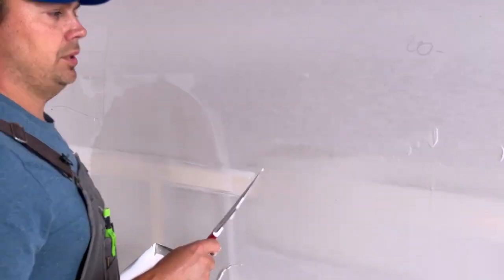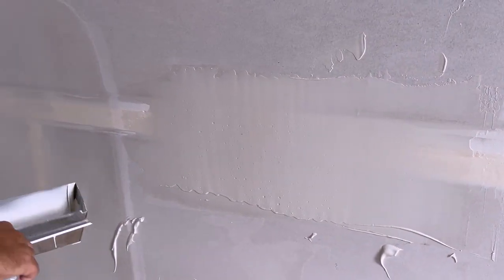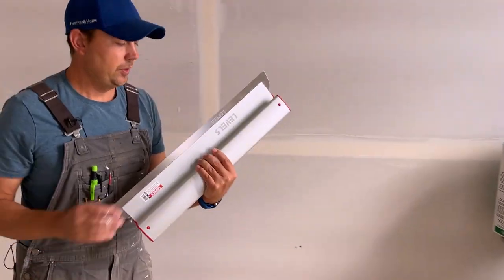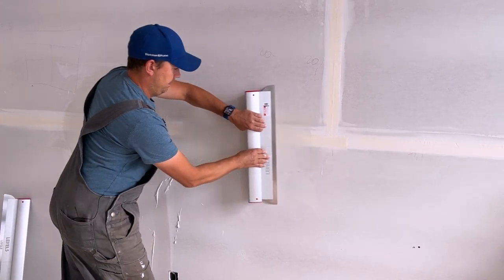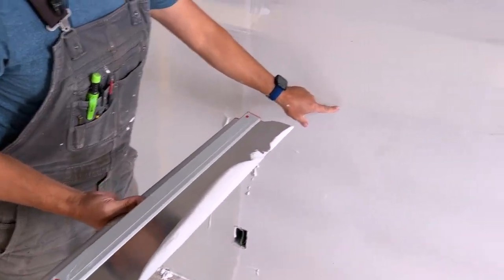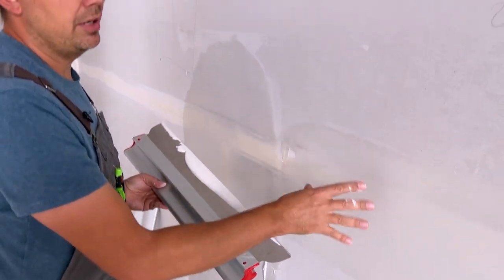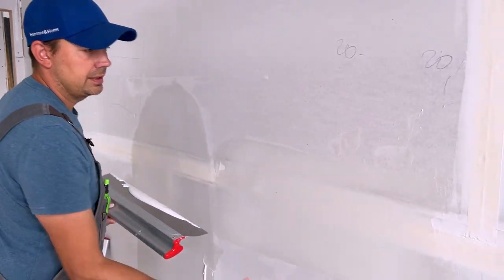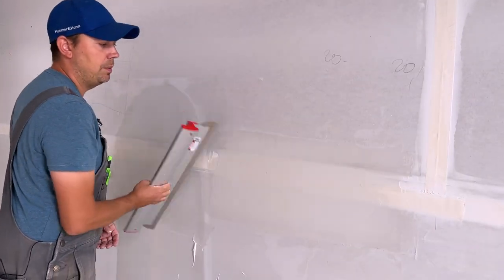However, if you don't want to use this and you want sort of the cheat, then what you do is add your mud. It's not very pretty. Then I would grab my 24-inch skim blade — there's other brands out there, it's not just level five that makes these. All the brands make these different types of skim blades. And then you'd come at it like that. See, because it's wider than the actual mud area, I didn't have to feather out the edges. So anytime your blade is exceeding the mud itself, you really don't have to wipe it down first. That's a huge benefit to using a blade that's larger than the actual surface area that you've applied your mud to. So this is pretty much flawless. I can come back and second coat this later. I'd add it with the 12-inch and then come over it with the skim blade. Wipe it down. Perfect.